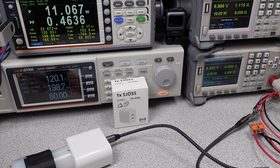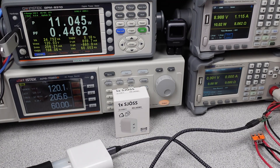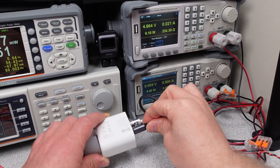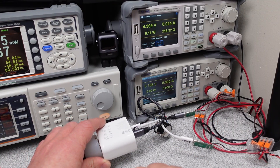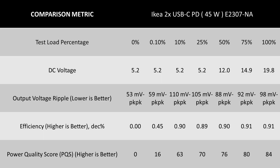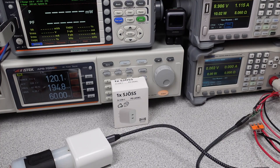The real thing is what happens when a second device gets plugged in. As usual, there is an interruption time when you plug in the adapter and it negotiates for more power — unless you use this adapter I threw together, which holds the voltage up while it renegotiates. The basic performance is not a surprise. The efficiency was actually better on this one versus the 30 watt adapter, the voltages were almost spot on, and the ripple was low. This doesn't seem like a value adapter at all — this seems like a good adapter.